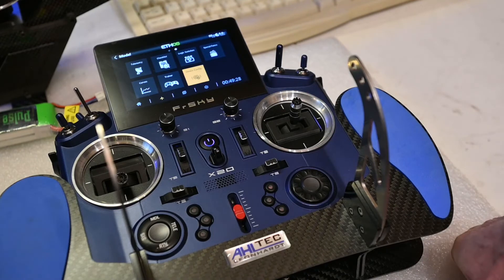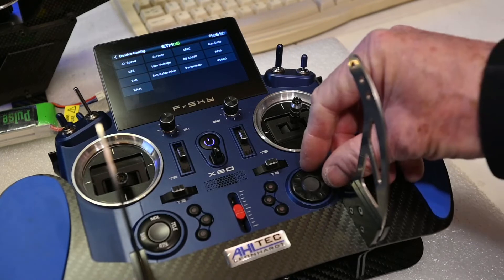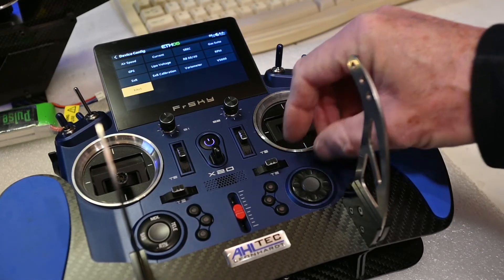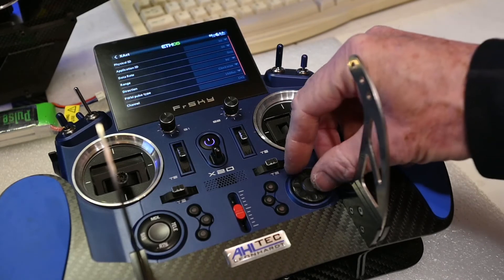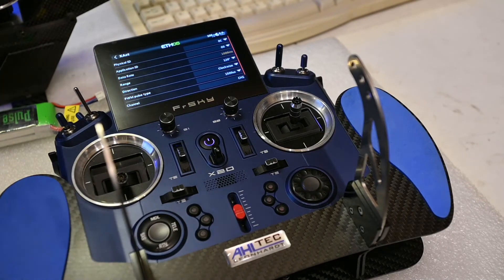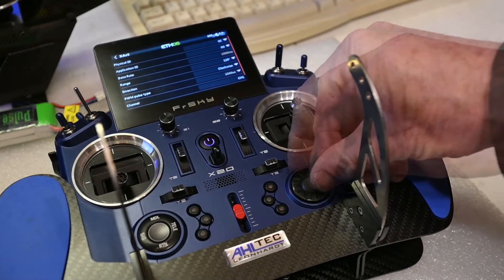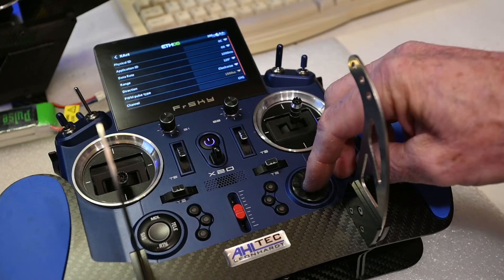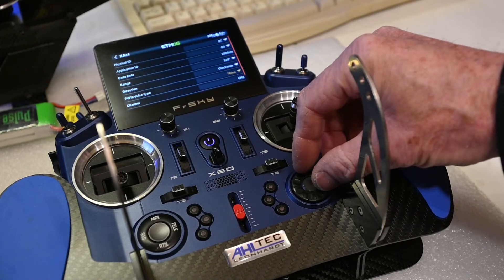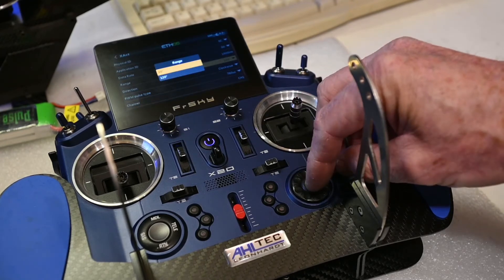The device config is the proper field, and at the very end is the Exact servo. Since I am already hooked up to the servo, the screen comes alive. Here at 1500 microseconds, I switch to 760 microseconds and reduce the deflection to 90 degrees.